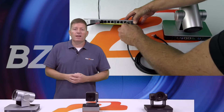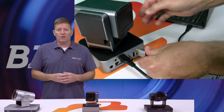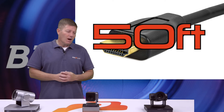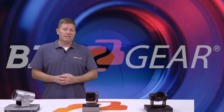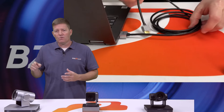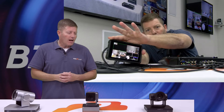Let's go over the connections. HDMI — high-definition multimedia interface — used on TVs, DVD players, cable boxes, has a distance limitation of about 50 feet unless you use a special active cable, which can get pretty expensive. I usually don't recommend HDMI unless it's for a 4K application where SDI is only 3G and will only pass 1080p. In that case, you'd want HDMI extenders to extend the signal beyond 50 feet over Cat6 or Cat5 cable back to your production station. You can also loop it out to a local monitor to show what the camera is recording.